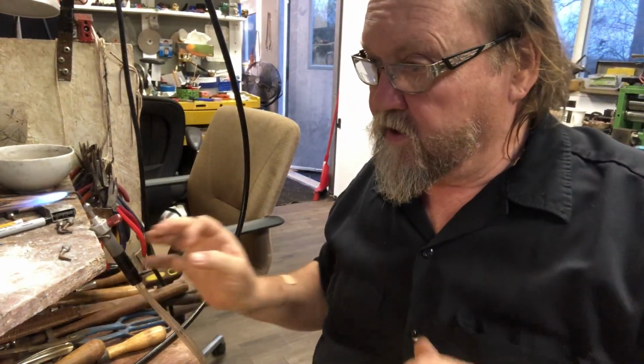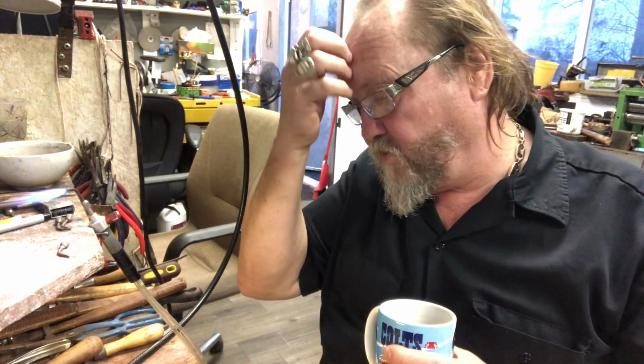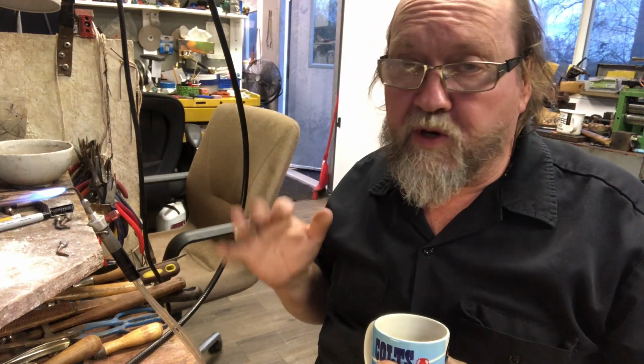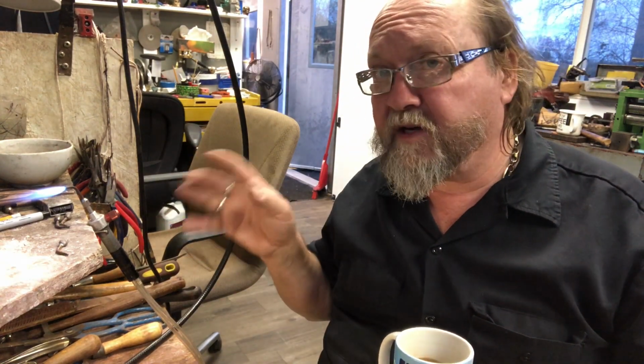Okay, I'm going to run it for 10 minutes. So 2, 4, 6, 8, 10. So 10 of them done. Remember, each one takes time: you gotta set up the waxes, spend 10 minutes with each wax. Then you get the investing and the casting and the burn out cycle, and then cutting off the sprues, another 10 minutes for each piece, and then soldering on another 2 or 3 minutes for each piece, and then cleaning.